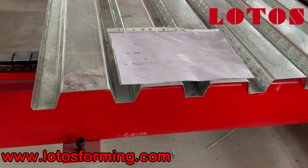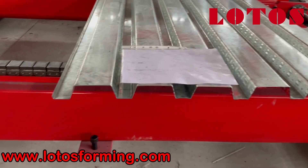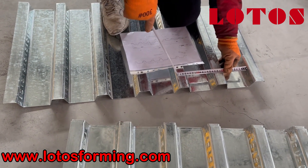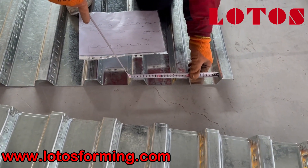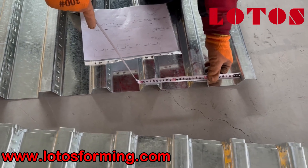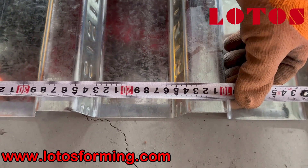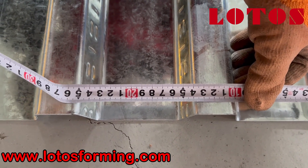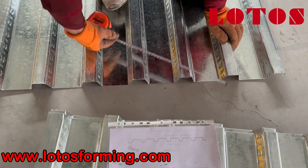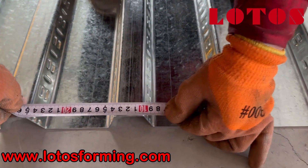We have changed this machine — the 1.5-inch decking floor — to the flat end. The distance between the peaks measures 151 mm; on the drawing it is 152 mm. The top measures 38 mm.